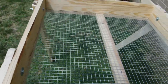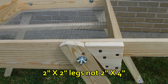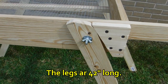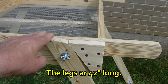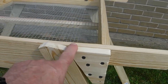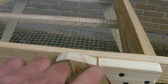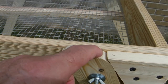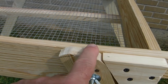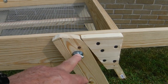He also changed the size of the legs. We had two by four legs; Will went with one by three — three quarter by three actually is what it is. We picked up on that because it lightens it up a bit and it works just as good. We also took this out of Will's playbook — we rounded the edge of these legs because this creates a pinch point. Believe me, you will get pinched there if you don't round those off. So that's a little safety feature.